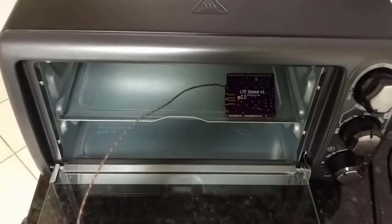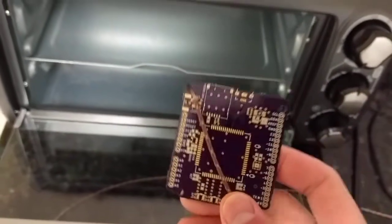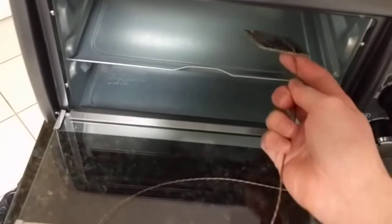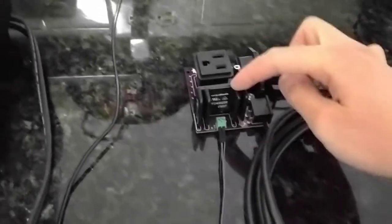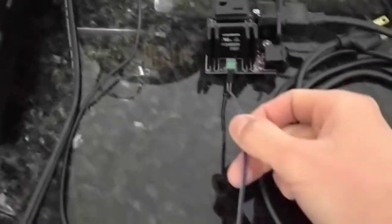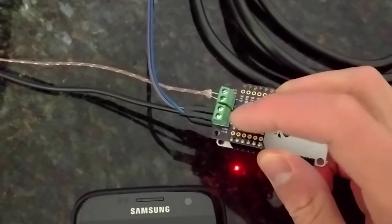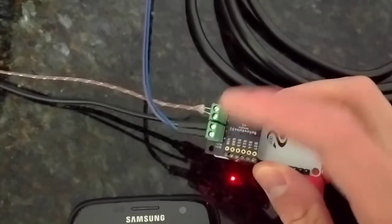So what we have here is a thermocouple. Right now it's on this scrap PCB — you can see the thermocouple tip is routed through a hole on the back of the PCB. This gives it enough thermal mass to make the temperature readings more accurate during the reflow process. And then we're controlling the entire toaster oven with the Sidekick relay module here. These are the relay control inputs, just two wires. You can use these convenient DuPont male-to-male wires, and this goes directly to the ReflowDuino 32 backpack on one of the screw terminals. The thermocouple is just attached to the other screw terminal.